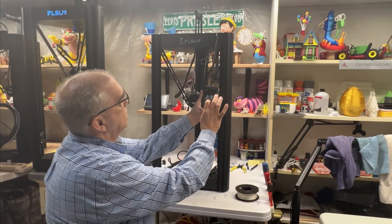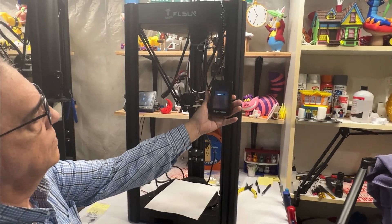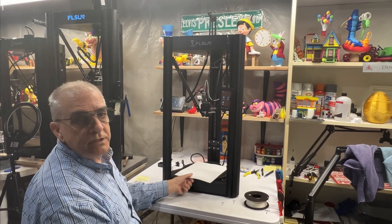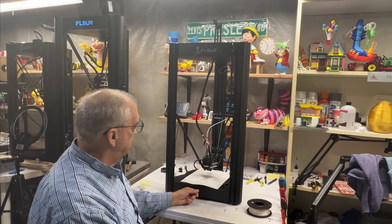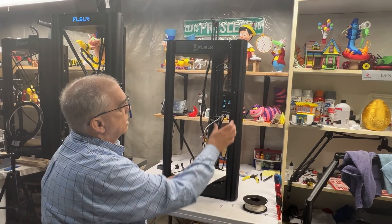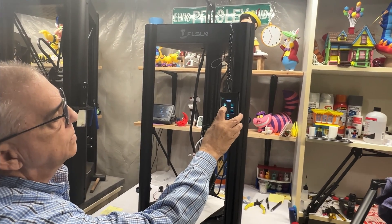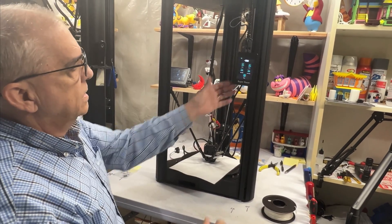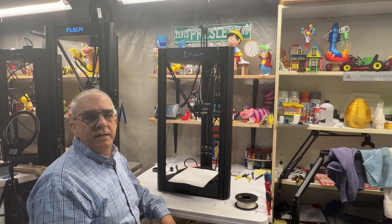Move the Z back down — I do this two or three times just to make sure everything stays where it's supposed to. This is the second time, and I can see it's a little more loose, so I'm going to bring it down one more 0.0125 increment. Right there — that's perfect. Save.